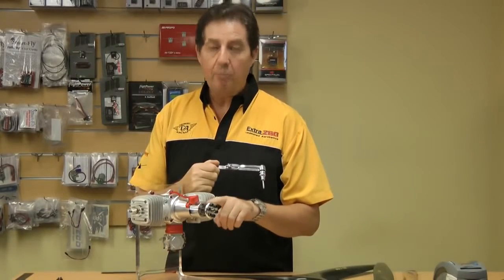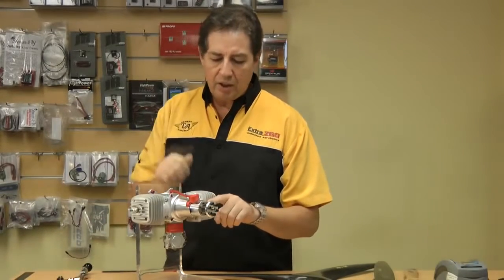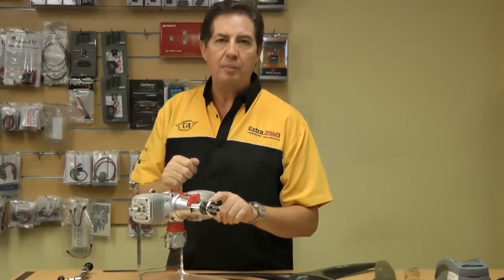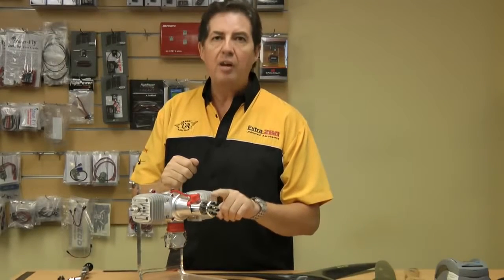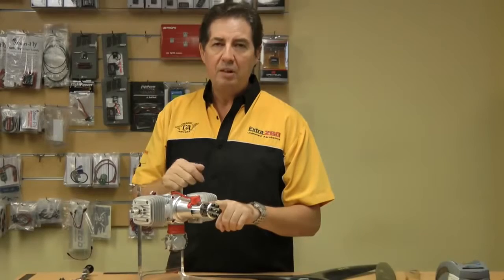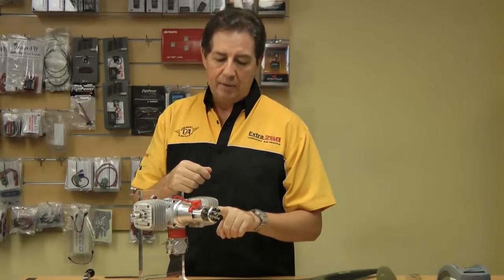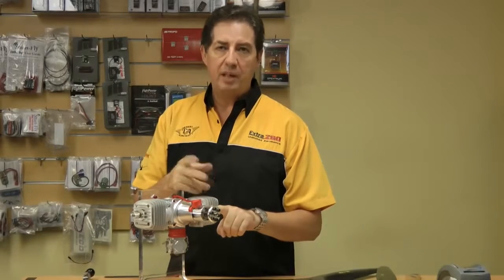Now, some of the problems we see with prop bolts, we'll get guys ring up and tell us, "I broke all my prop bolts, there's something wrong with the bolts." Bolts only break when they're loose. Prop bolts will come loose and they'll all snap one after the other, and this will all happen in one flight. Reality is, check them, keep them tight.